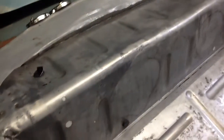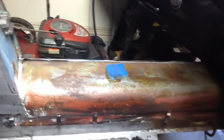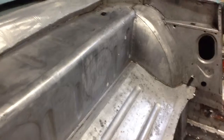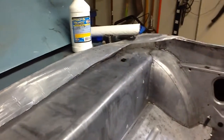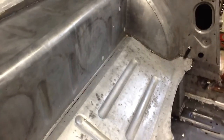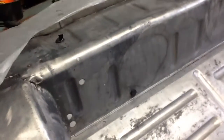What I found worked best is to spray it on and scrub it with a little scouring pad from the kitchen. The sponge part is nice because it keeps liquid where you're working. Just a quick scrub — no hard work or anything like that. And then I wiped it down right afterwards with a paper towel. That seems to be the best way because it's not flash rusted and it's not all white and crusty.